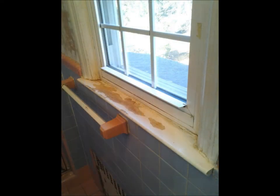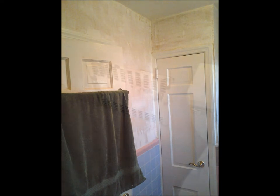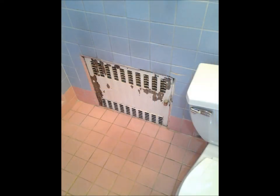I also found some rot in the corners of the windowsill as well as chipped paint on the interior surface. This was ultimately repaired with a combination of wood filler and caulk. There was also a fair amount of gapping between the walls and trim that needed caulking. Several other minor items, such as doors that didn't close properly and missing grout along the wall tile interface, were identified and resolved. Lastly, the cast iron cover of the steam radiator had some rust on it that caused the paint to lift off. The rust was remediated and the voids were patched before repainting.